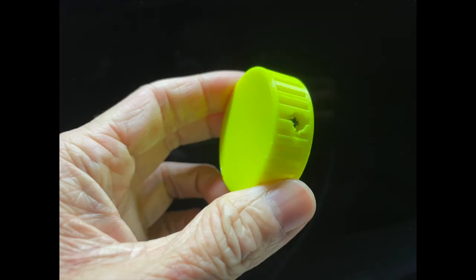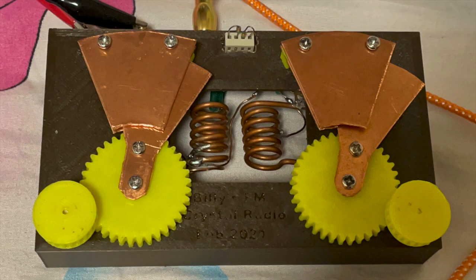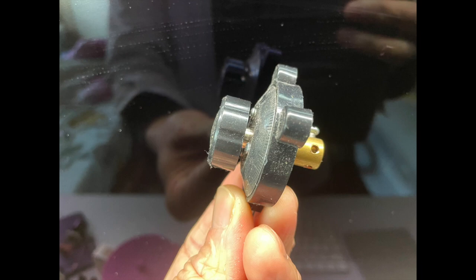As the FM crystal radio's tuning range is very narrow, you need a bigger knob to help you fine-tune to a station. Sometimes just less than a degree angle change will make a perfect or noisy reception. Also, you need to keep the human body as far away from your radio as possible to avoid impacting the capacitance and the frequency of the radio. So you need a rubber or plastic shielded knob as big as possible, as far away from the box as possible. It's also helpful to use a reducer, which is a gear with a ratio of 5:1 or 10:1, so you can tune to the right station in even finer turns.